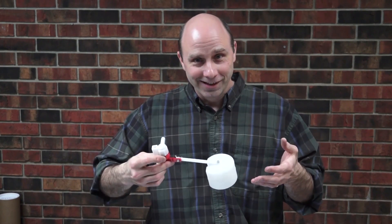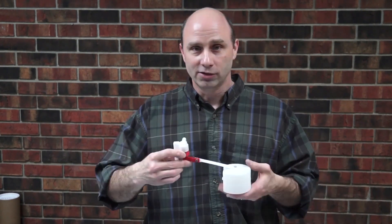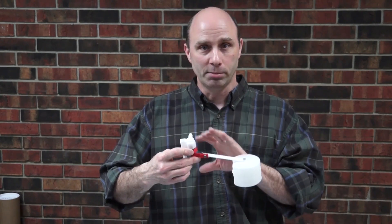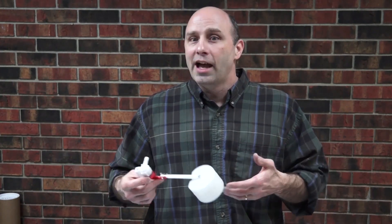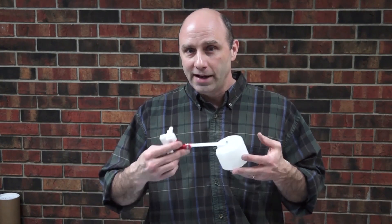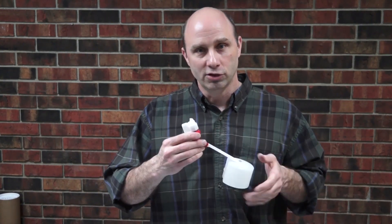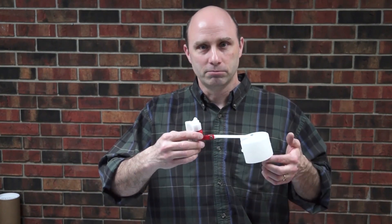Because it's dripping so slowly, it might take a while for that to happen. I've seen instances where it takes 15 to 20 minutes to completely stop dripping. So that's something to check — make sure you're actually having a valve leaking problem and not just normal operation of the valve, where it continues to drip for a short period of time after you think it might be closed.